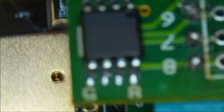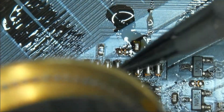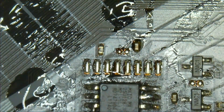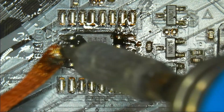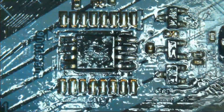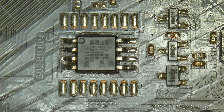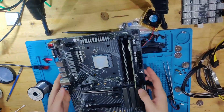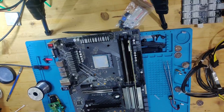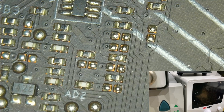So I've now flashed our BIOS chip. This took approximately 15 to 20 minutes. We are now getting the BIOS chip off and putting it back onto its rightful place — you can see me putting the freshly flashed BIOS chip back on. Also cleaning it up, as some solder pads had a little too much solder — I went over it with the soldering iron once again. After that I tried to boot the board up because I was very sure it was ready, but it actually had the same behavior as before.